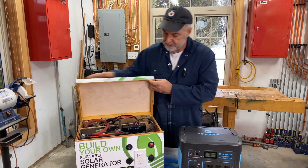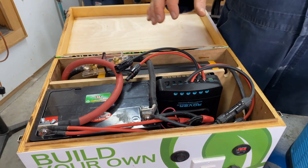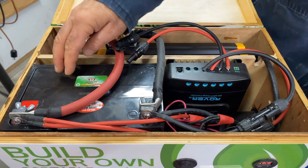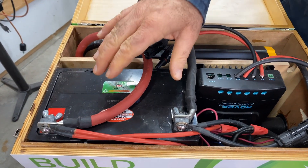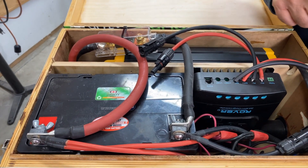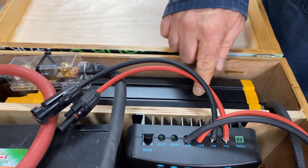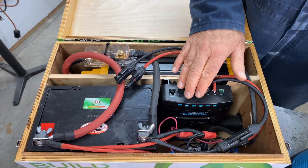You can buy a ready-made solar generator or you can build your own, and that's what I've got here — all purchased components from various suppliers. The same basic three components that are in the manufactured unit are also in here. Starting with the battery — this is a lead-acid battery from a forklift actually — it provides the energy storage. But having energy in battery form is only so useful; what we really need is AC current. A device called an inverter, which you see back here, takes the DC current and turns it into AC household current.